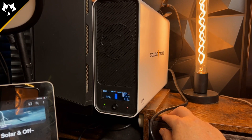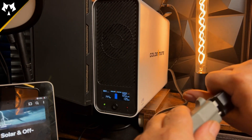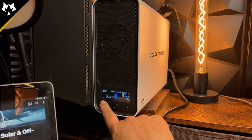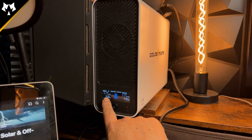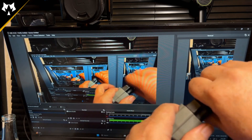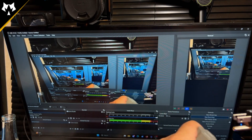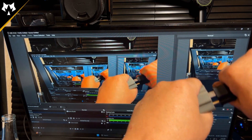You might be able to hear that beeping sound. As you can see, we have no more power coming in, but the UPS is outputting 120 volt AC from the built-in inverter and we're still drawing 133 watts. Let's go ahead and plug this back in — pulling 122 watts, 135 watts, and 117 volts AC back from the grid. Here's my computer screen — this is my OBS recording software so it looks a little different — but you can see there wasn't even a flicker. The UPS activated seamlessly. Go ahead and plug it back in.